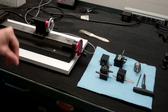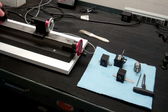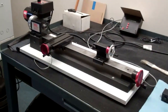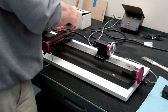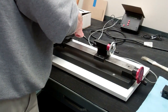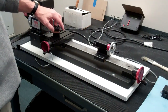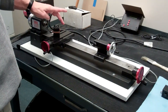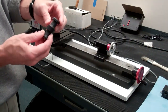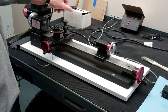One thing that is important to check with your turning tools is the height of the tool. When you have your tools in the cross slide, the intention is that the cutting point — the single point that's doing the cutting on the tool — is at the same level as the center of the headstock or the center of the part. We do have a tool height gauge that you can use to check that you indeed have the cutting tool at the right height.